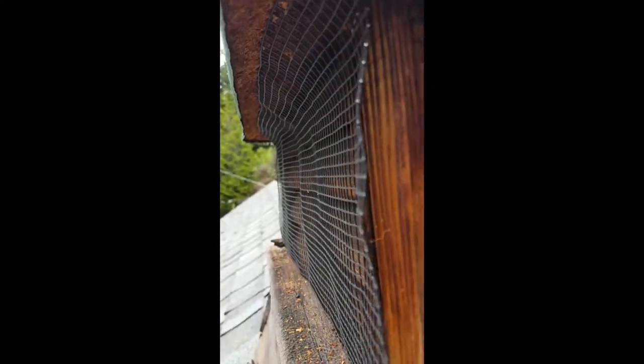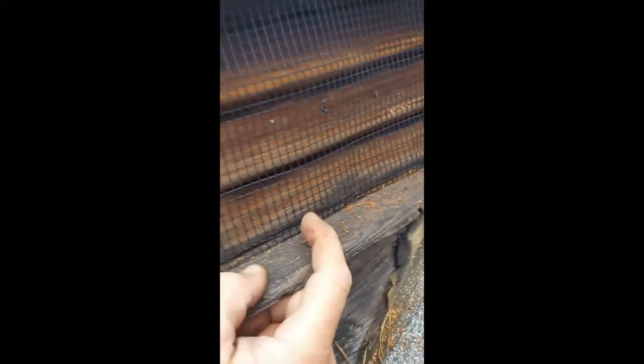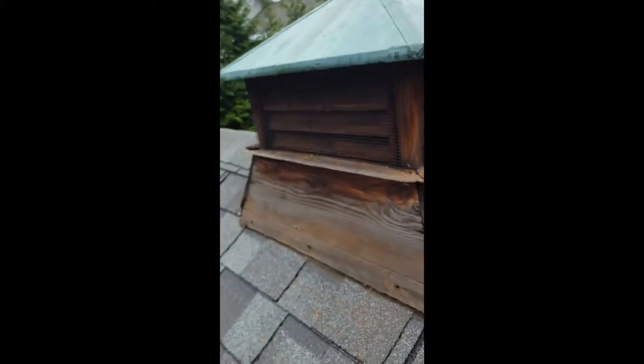From the ground it's not really going to show up. I prefer to have it on the inside, but we have this gap with this little particle board on the top. We're having to push the wire in and bow it so it has tension against here and the bottom edge. I'm going to put some screws down at the bottom and one at the top. These little gaps up in here — we'll put some foam up in there to prevent the bats from getting in, and then run a bead of caulking along the bottom all the way around. That's how we're going to secure this cupola.